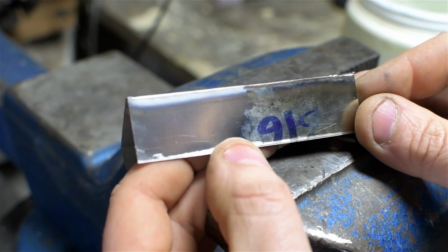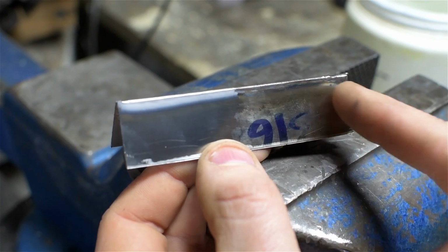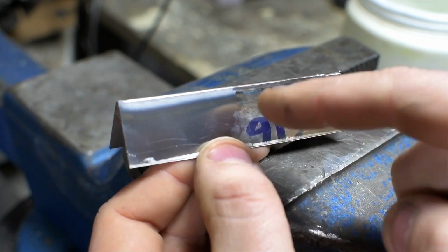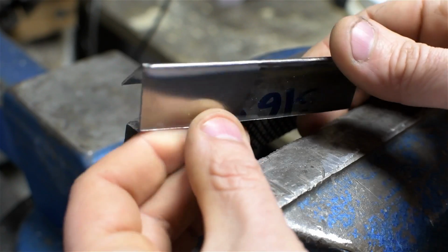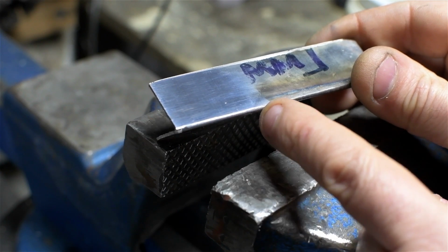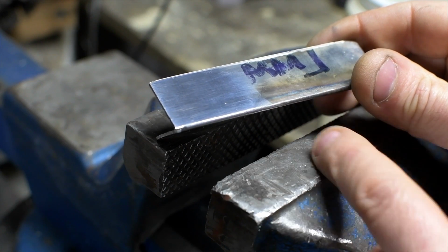So here I just have washed it off. This is the side that wasn't pickled, and this is the side that was pickled. You can see there's a little bit of an opaque line near that weld. What I did is I took the other side and just hit it on the buffing wheel. Again, pickled up to here and then buffed, and as welded on the right.